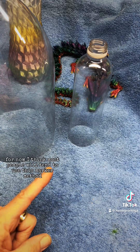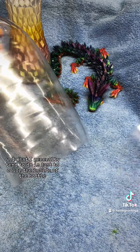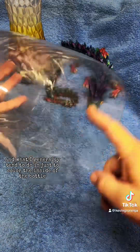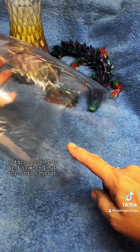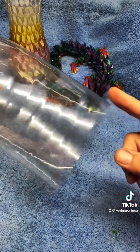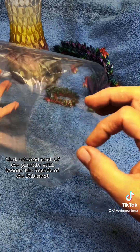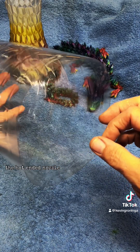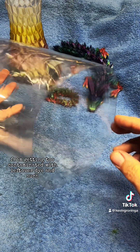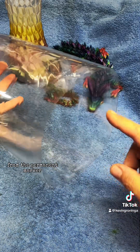For now I think most people will tend to use this marker method. What I generally tend to do is just color the inside of the bottle — the inside surface. The reason I do that is when I cut this into a ribbon and put it on my spool and run it through my pultruder, that colored part of the plastic will become the inside of the filament. That will prevent the inside of my printer, the hot end and nozzle, from getting too contaminated with leftover dye from the permanent marker.